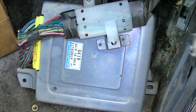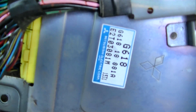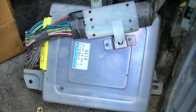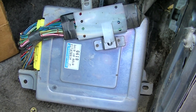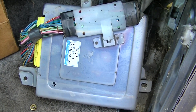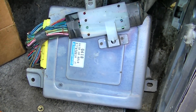Some of the worst ones that plagued Mazdas were Mitsubishi units, but another really bad one right now are the early 1990s Hondas — Accord and Civic. The capacitors in those Nichicons are leaking and eating them up like crazy. If I had an early 90s Honda I would have already recapped it.